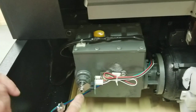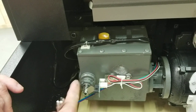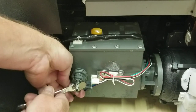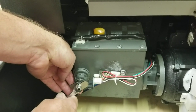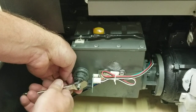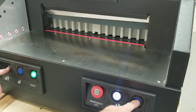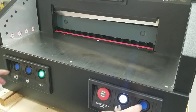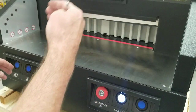To fix it, we need to move the tab. It rotates clockwise, so the closer you move the tab clockwise, the sooner the sensor will detect it and the sooner the blade will stop. I'm going to move this tab clockwise so it senses the blade a lot sooner. There was still a little double-pump — it went and came back up just a bit and then reversed itself, hitting the sensor again.